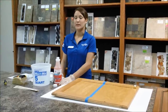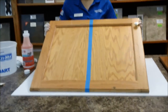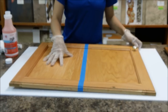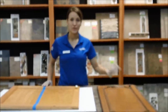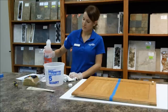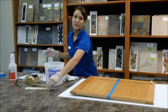In some cases you may need a more heavy duty cleaning rather than just a general cleaning. In this case I have a cabinet door that is pretty much in need of a heavy duty cleaning. You can see the grime all the way around here and it's got some drizzle areas. I'm going to take 8 ounces per gallon of water — they have it measured out for you on the can. I'm going to use a stir stick to stir it up a little bit.